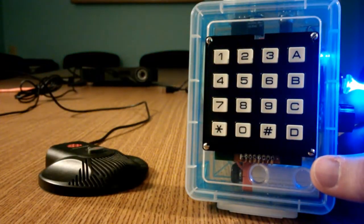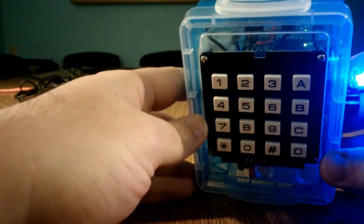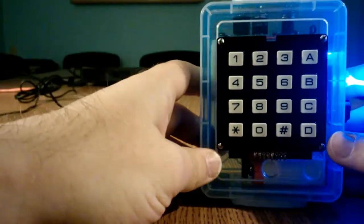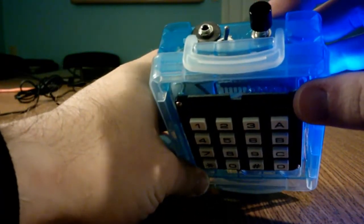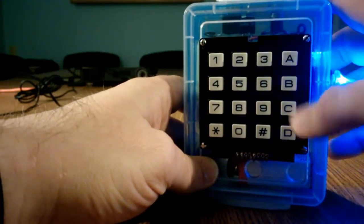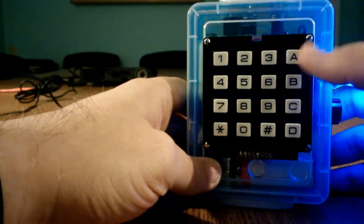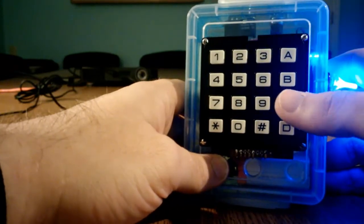Everything is pretty much the same as far as the blue box mode goes whenever you start it up. It boots up and goes into domestic mode. Domestic mode is basic MF, with the 2600 button now at the top for supervisory signaling. Red box tones are A, B, and C. I did add the nickel back. That was weird to say. And also, for recording tones for speed dial MF, you hold in C now.